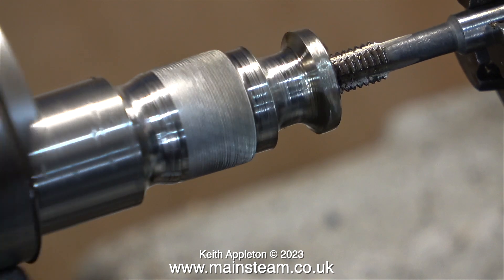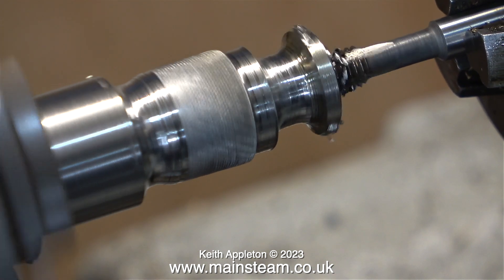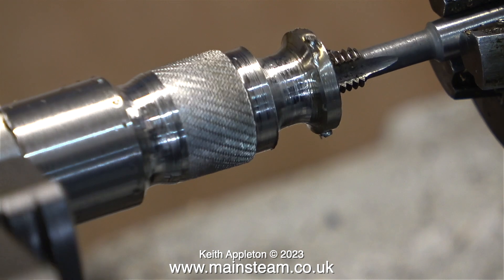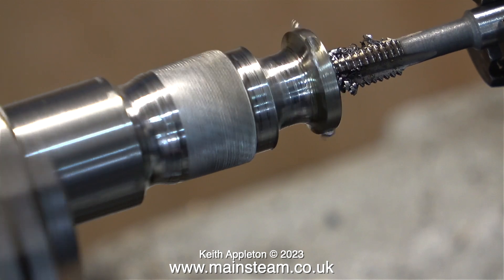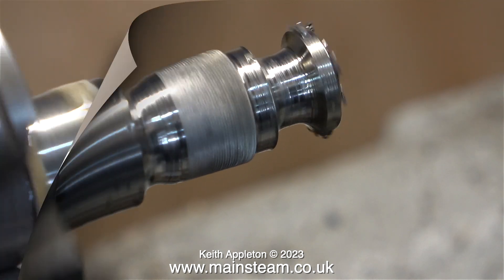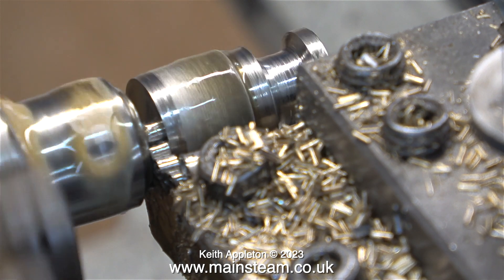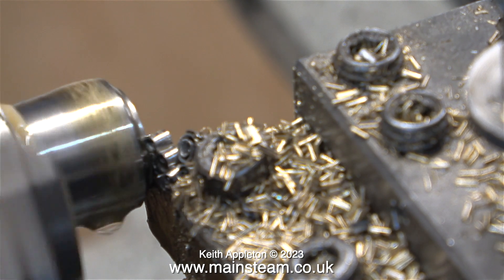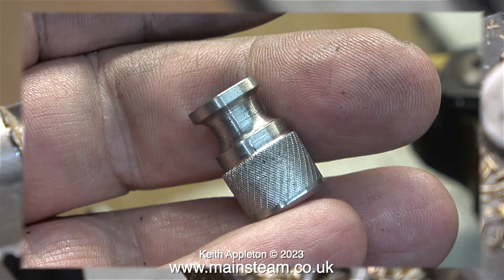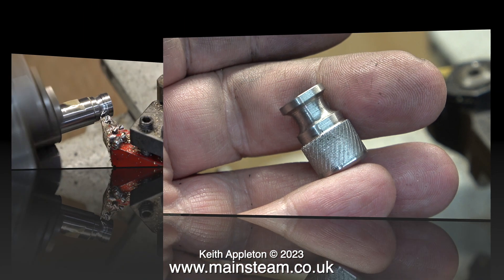You may find this interesting: I'm tapping the hole and as you can see the tap is slipping round in the chuck, because this is a keyless chuck and it's not as tight as one that uses a chuck key. Not good engineering practice obviously, but at least I don't break many taps. I really like this old Boxford lathe. This clip shows me parting off quite a hard piece of stainless steel with a small parting tool. Once it had cooled, here is the part in my hand — it still needs a little bit more work but you get the general idea.